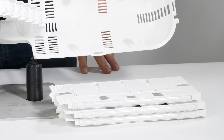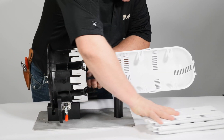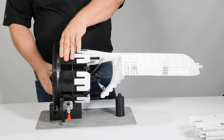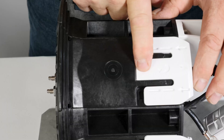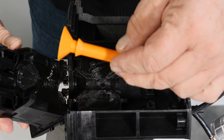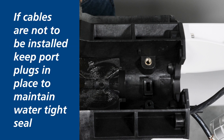Set aside all trays in a safe location until needed. Release APEX from the stand and orient as desired for cable entry. Ports 1 and 2 will be used in this video for entry of backbone cable. The closure will be on the stand with the basket upside down for ease of installation. To open the APEX sealing wedge, depress the locking tab and slide the sealing wedge down toward the bottom of the base release latch. Slowly rotate the top of the sealing wedge from the base and remove the orange port plug as the wedge is released. Set aside the port plug if a cable will be installed in this port. If cables are not to be installed, keep port plugs in place to maintain a watertight seal.